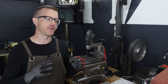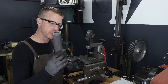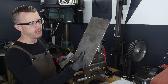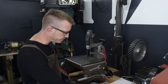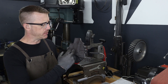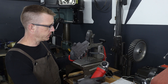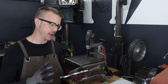This gives me tons of ideas, and a lot of amazing concepts are coming to me in this process, so I do appreciate it. Just so you know, I have already cut all of the tube steel necessary for this and some of the plate steel. I've got the base drilled out, and it's been soaked in vinegar to get off the mill scale. I have the quarter-inch plate work rest here — I still need to notch out for the grinding wheel itself. But this morning I sat down with a cup of coffee and a scrap piece of 3/8-inch steel and drew out all the tabs and articulating tabs that will go up underneath the work rest. This is literally all the steel you need for this — to create the spacers and everything on the grinder itself. I just need to cut this out so we can actually start welding this thing together and hopefully make a test run.